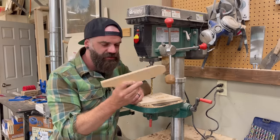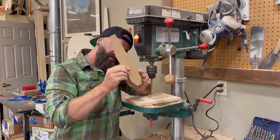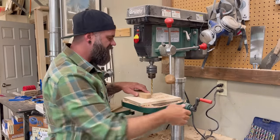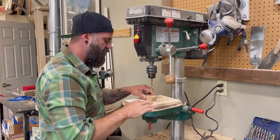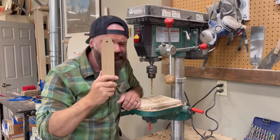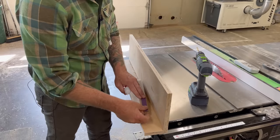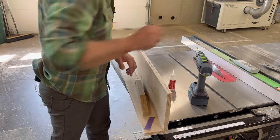The first thing you want to do is get a scrap piece of wood — this is just some scrap white oak. On one end, I cut a nice steep angle, and on the other end I just cut off each corner to make it a little rounder. Take this piece of wood, stick it in your drill press or use your drill, and drill a hole right in the end. Next, take your little piece and a little strip of sandpaper — I just cut this out of a bigger piece — and you're going to glue it on to the end of your piece with some CA glue.